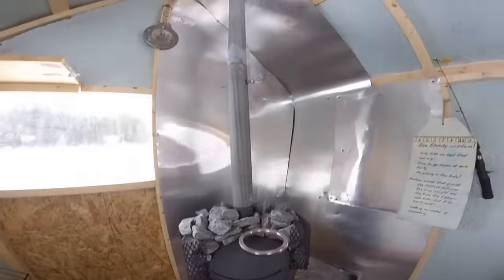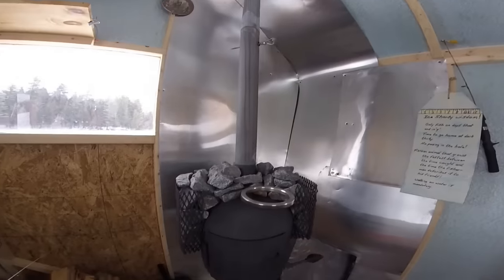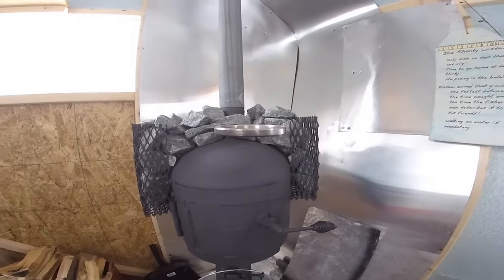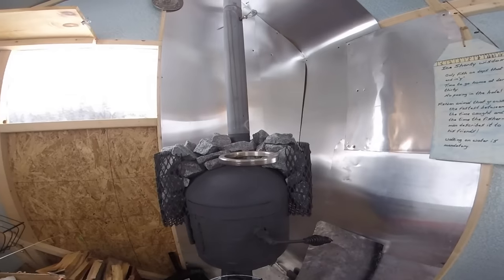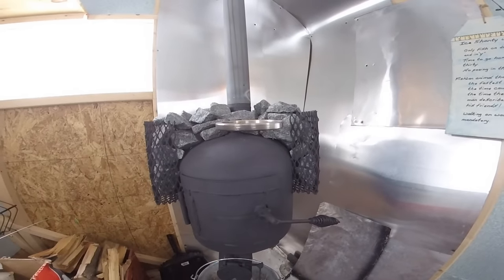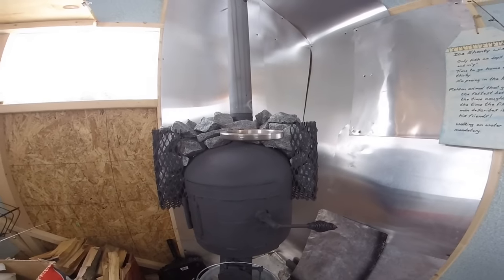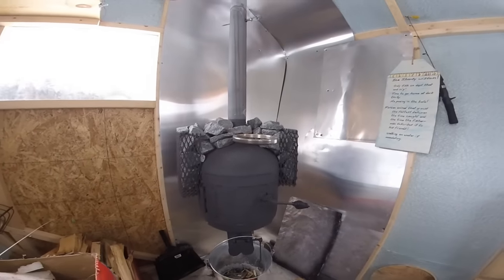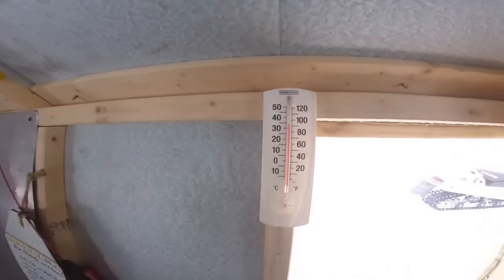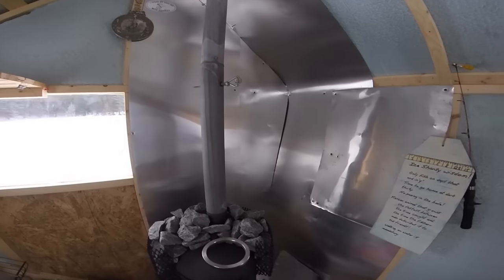There's a damper down here which is also the clean-out — got a wrench on there and a couple pieces of pipe. It's a three-inch chimney that goes right up through the metal roof. We added these rocks on here, and this grating is new this year. That helps hold the heat. The problem was that with such small pieces of wood that fit in here, it would get hot but as soon as the fire went out you'd start getting cold, so we put those rocks on there.